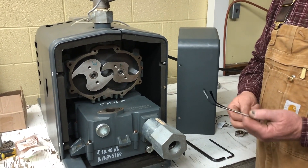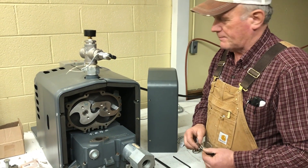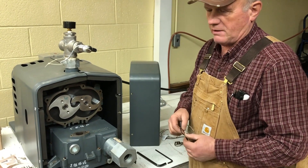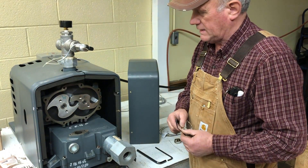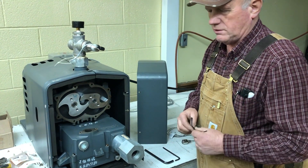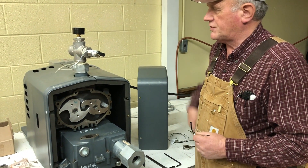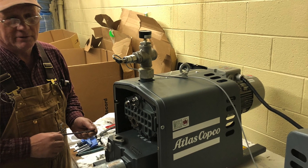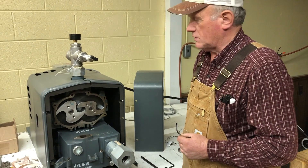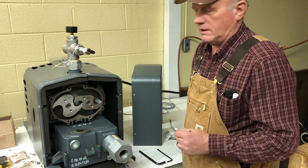The CFM on this pump is 48. You can use it from anywhere from 3,500 to 5,000 taps. If it's not a real long run, they might get a little bit more than 5,000 taps. We used this pump last year down at Bissell's and it did it really easily — we only had almost 2,000 taps. CFM stands for cubic feet per minute of air being sucked out of your vacuum lines. The statistic is you need about one CFM for 100 taps, so at 48 CFM you could handle around 4,500 to 5,000 taps and do a good job.